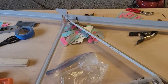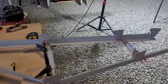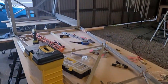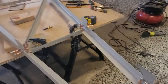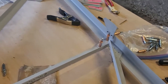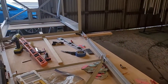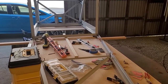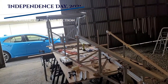I'm going to leave all this clecoed - I'm not going to drill permanent holes especially with the hole alignment issues. I'll either clamp or cleco it until everything is built up, including the members that come up from these gussets to build the rest of the tail. I want to get all of that done - possibly the entire structure - before I start drilling holes. If I did something wrong and got holes off without realizing it, I don't want to make it permanent.